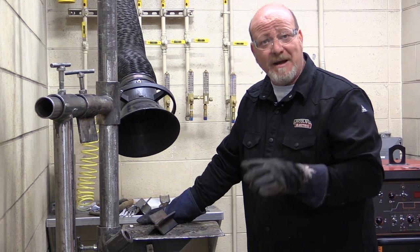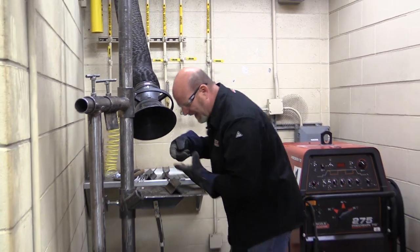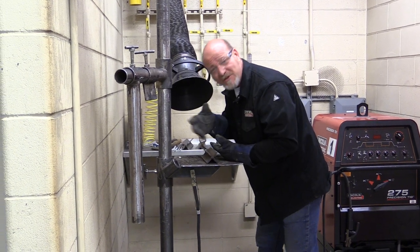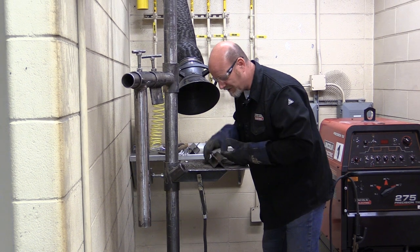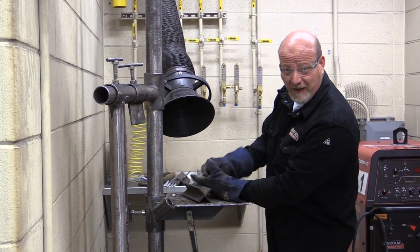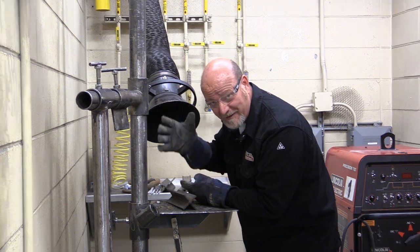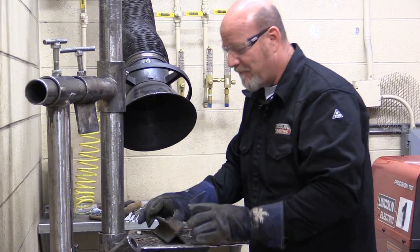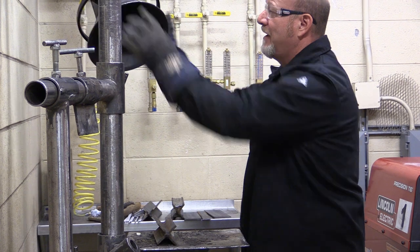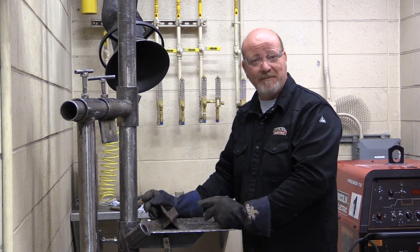The other deal with smoke is positioning your body so your head's not in the smoke plume. You can't stand over top of this thing with your head and have all the smoke go up around your face, because you'll be breathing this stuff and you don't even know it. You need to get your body position — which we're going to talk about in the next video — and get your head out of the way of that smoke, so you're welding and the smoke is going around your head, not into your mask. Make sure you position your snorkel correctly, and if you do those two things, fumes are no problem in this shop.